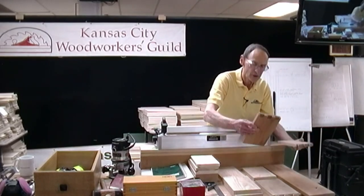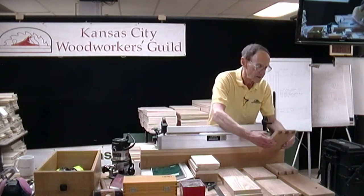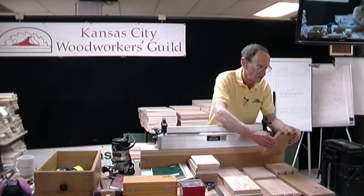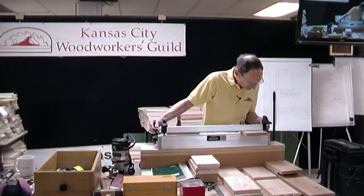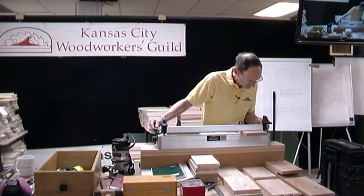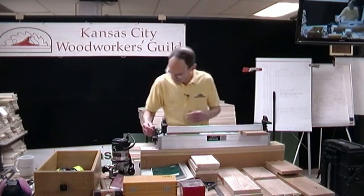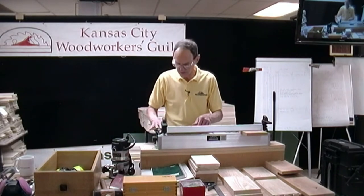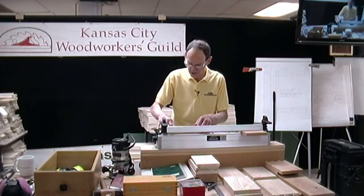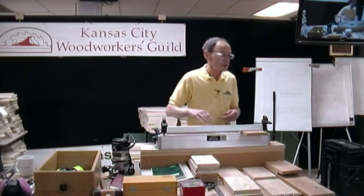the pin board I had at a setting of 13/16 plus a smidge, or maybe a half a smidge, I don't remember. Let's see, 13/16. And we'll talk about why it's necessary. Gee, I thought you always set the pin and the tail boards at the same thickness, and that being the tail board thickness.